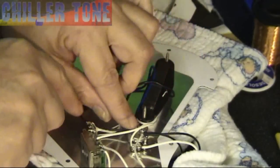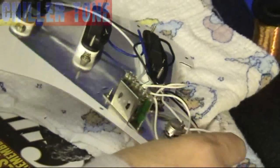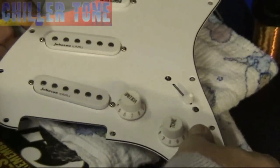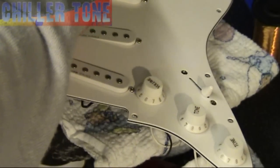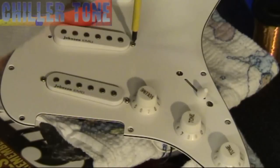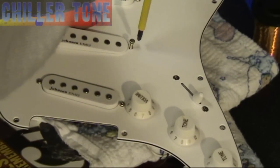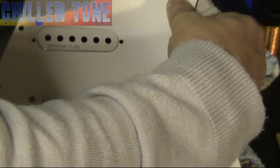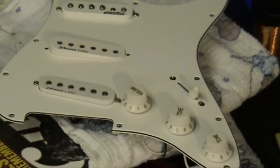Just looking at this — looks quite embedded there, I might have a little bit of difficulty getting this out. There you go. So I'm going to turn the plate over and, holding the back — so that's out. Remove the screw and the spring. Supporting the pickup. Remove the screw, feel for the spring behind, and remove that. So we've now removed our second pickup.